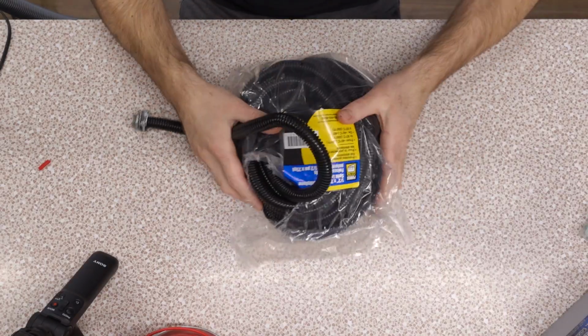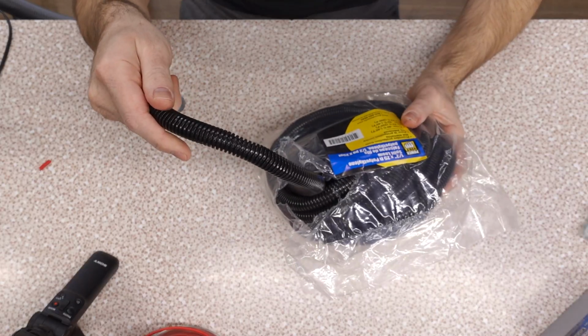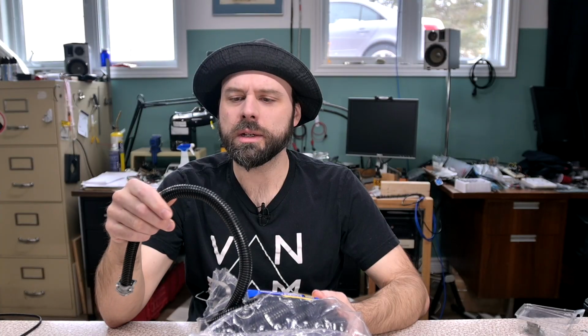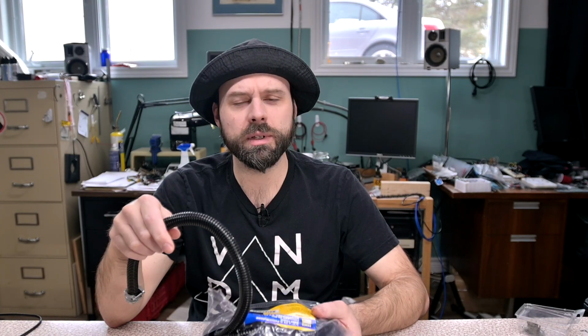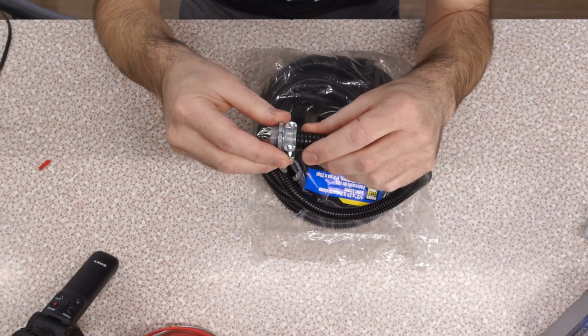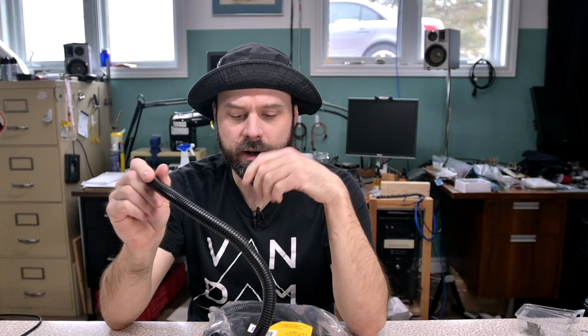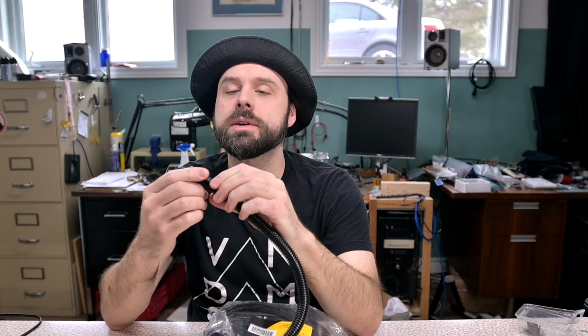Meanwhile, it's just kind of raw wire. Needs some sort of protection, you know, dress it up as it goes in the general up direction. So I just got some of this stuff. This is that corrugated loom or whatever you want to call it. That's for protecting wires in automotive. Now this wouldn't be to code for actual 120 volt, but for low voltage DC applications like this, it's going to be fine. And it seems like it fits reasonably well in 1/2 inch connectors, which is why I put that 90 on the box when I reworked it, because that's where this is going to feed in and out. So I think one of the first things I need to do is fit this up, get the proper length, get it mounted up there, and then we can run wires through it.